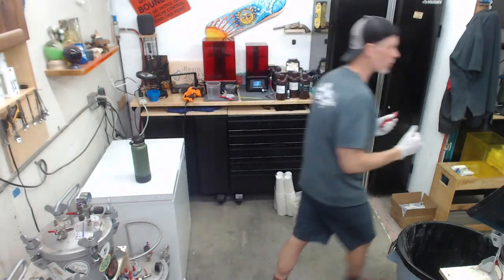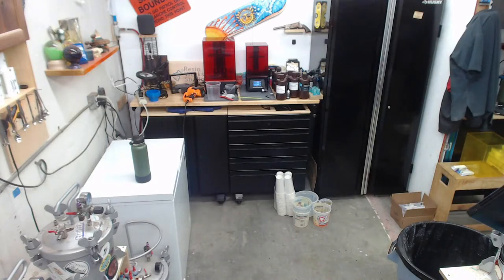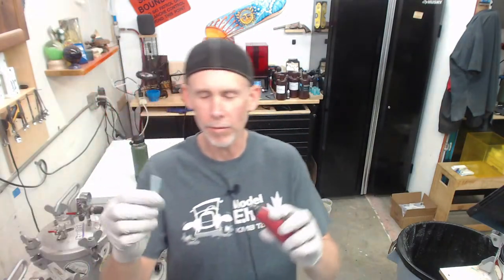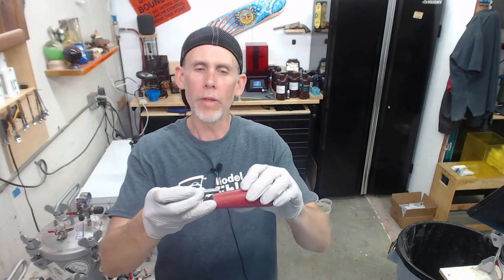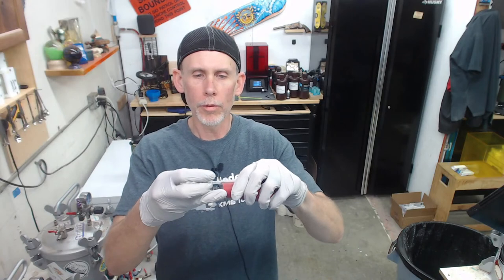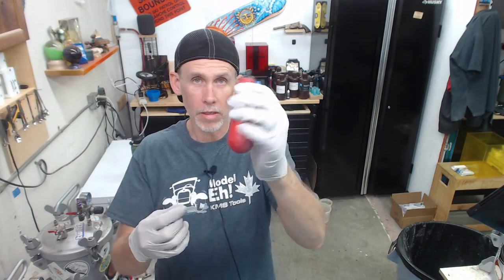And so it's a pretty simple project on the lathe. And I didn't see if anybody had any objections to my work holding method. But I went and bought a bolt. And so I'll just glue that into the blank. You drill a hole in the blank once we get it ready. Glue that in. And I've got myself a handle.